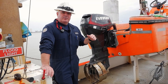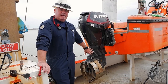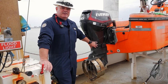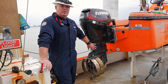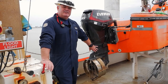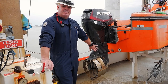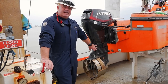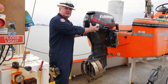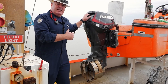One of the last things we'll do when inspecting the rescue boat is to verify operation of the rescue boat engine and the steering and throttle controls. Typically you'll find an outboard engine. Outboard engines require cooling water when they run. If you run this thing dry for even longer than 10 seconds, you risk damaging the impeller and a lot of maintenance is due. These have to be ready in all weather conditions, so you may find them with a heater-style blanket on it, or it may be a diesel outboard. This one happens to be a gasoline outboard.